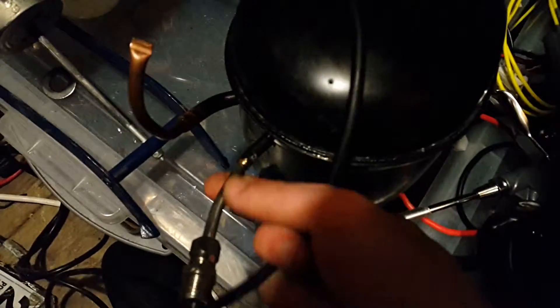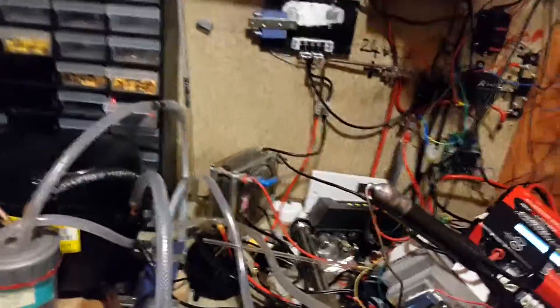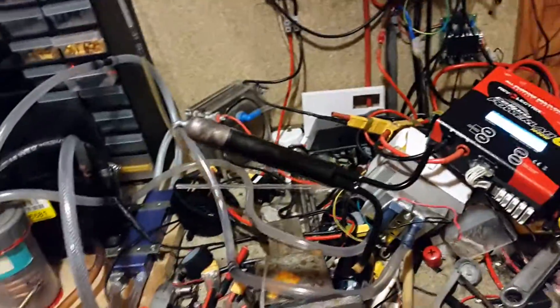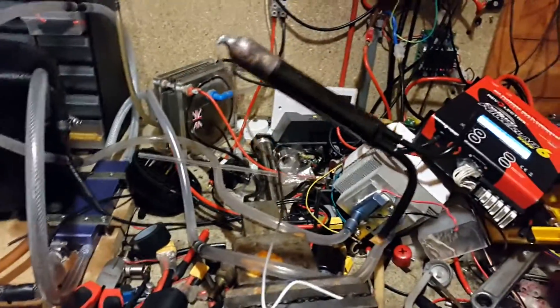The way I managed to solder these connections was by using an HHO gas torch, which is just a mixture of hydrogen and oxygen — it just splits the water up. It's not good for brazing because it's highly oxidizing; you just get a load of slag and the joint is rubbish. But it's great for heating up the joint for soldering.